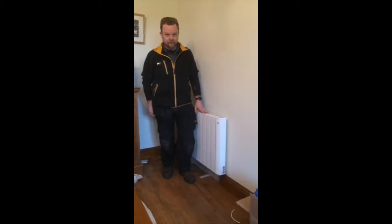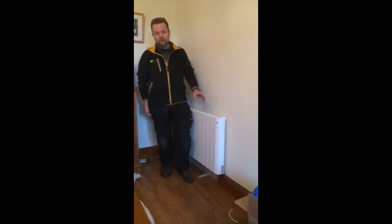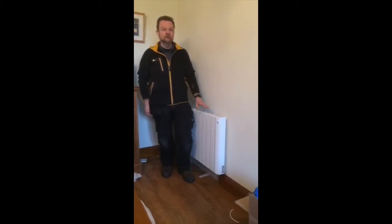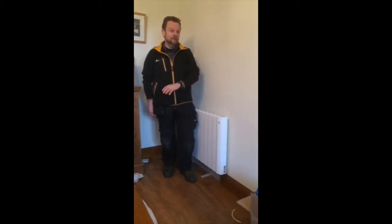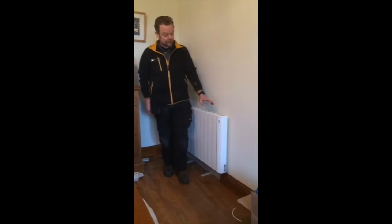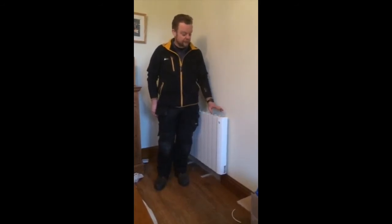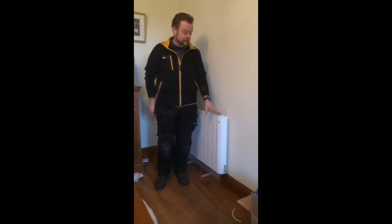In another room in the property we're working on, the storage heater has already been removed and the CaliSense put on the wall. The problem with old storage heaters is that you have no real control over how they release their heat. You basically decide today what heat you're going to need tomorrow, and if the sun comes out and it's warm you're getting that heat anyway — so you open your window to let it out. With these new CaliSense radiators they have a built-in thermostat and a built-in programmer on the top, and you can write a program very easily to control the temperature levels within the room.